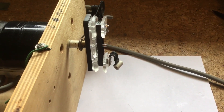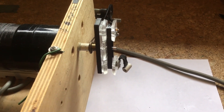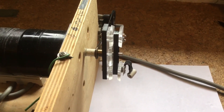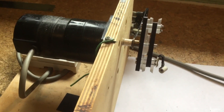The little piece of elastic and rubber grommet is to ensure that the former is held in place on the shaft, and also gives it a soft-start mechanism — because it will turn freely on the shaft, and when the rubber bung is pressed against it, the elastic is what drives it.